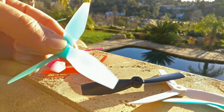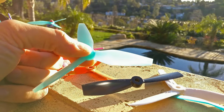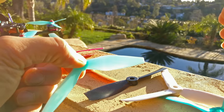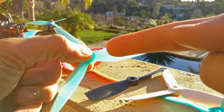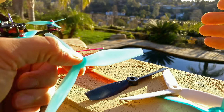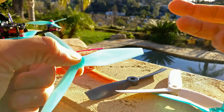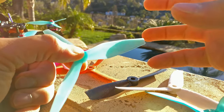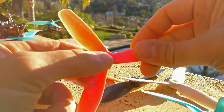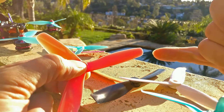As the blade tip cruises through the air, you get air blowing straight into it — high pressure underneath and low pressure on top — but you also get air washing over the side and outwards. When you have a square tip, all of that air — the high pressure and the low pressure — washes off the side and meets at the same time all at once, like jumping in a pool. That creates a ton of vortex drag at the end of the blade, making it really hard to spin at high RPM and killing the efficiency of the blade because of turbulence at the end. When you just curve the tip a little bit, it doesn't all wash off at the same time — you get distribution of that vortex off the end.